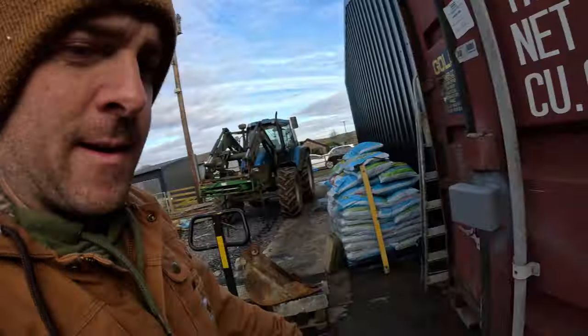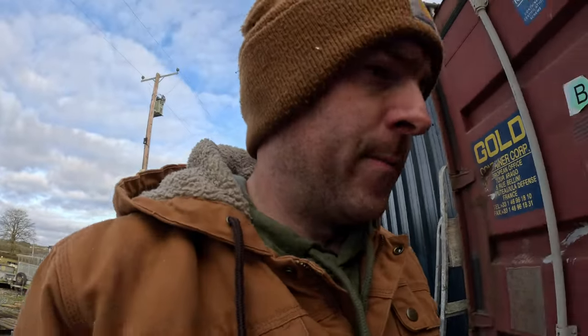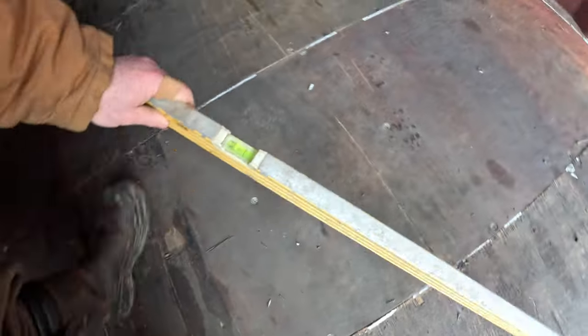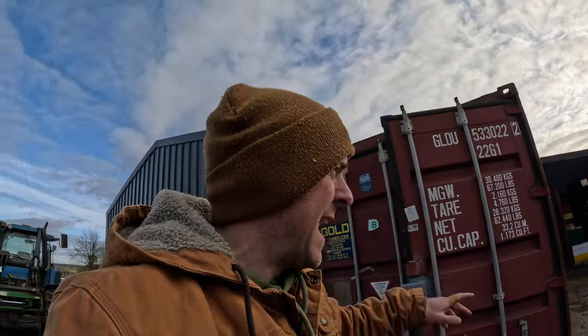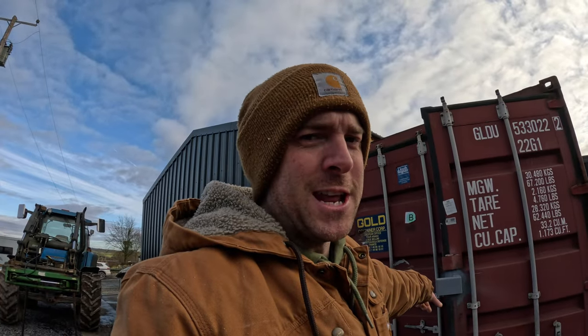So — pleased with that. Now, how do we get it level? It was pretty easy, just going on concrete. When the container delivery driver does come, make sure you've got levels and your slabs ready to go. The trick is you drop the container down first, then you go in with a level. On my first container I didn't think you needed to level the floor that much — it was on a slight wonk — and what you find is if your container isn't level, as you load it up the container slightly twists and then you can't shut the door. So that's a very important tip.